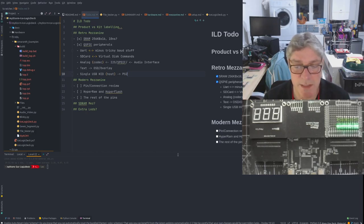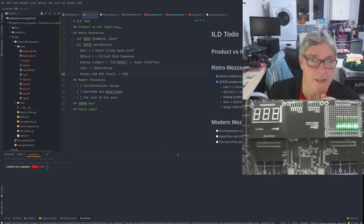That gets shrunken down if you're doing something like blob tracking. So what gets sent up over QSPI to the STM32 is a very small portion of that. It's like a set of coordinates and then the smaller rectangle of interest, successively. These are beyond the retro thing, but they are definitely in the range of the SRAM, 150k.